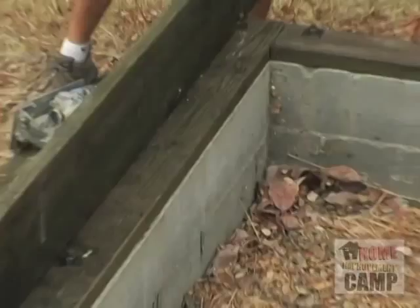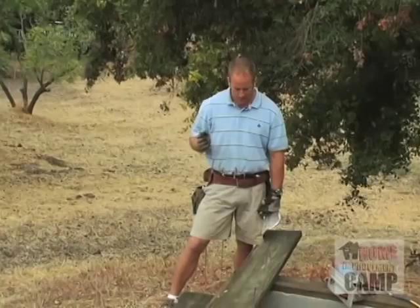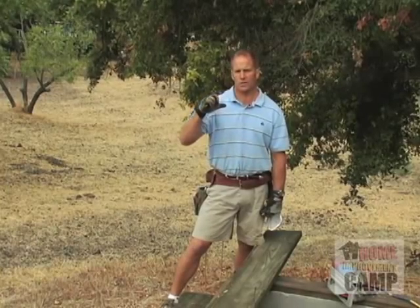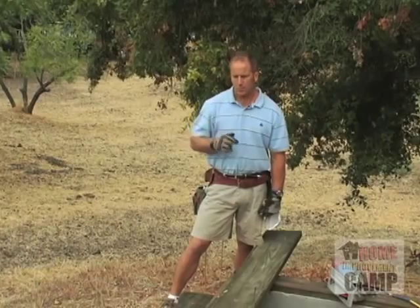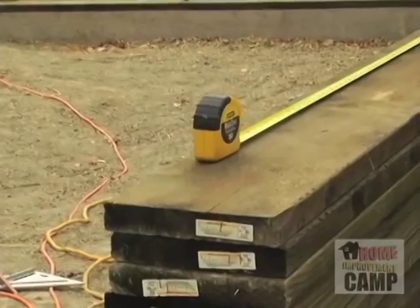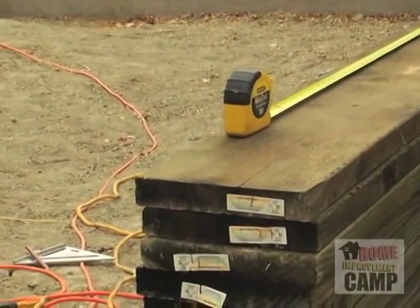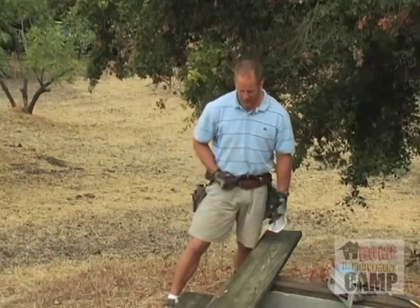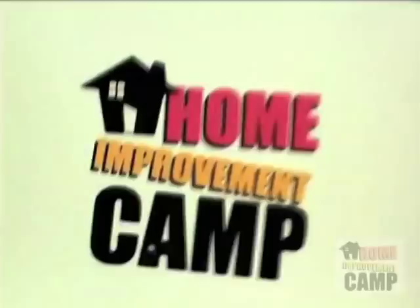This board is sitting on the foundation across here. It's as solid as it's going to get. So, if you had very small floor joists like 2x6s, you might be a little careful about how much you hog out. But here we have 2x10s, and these 2x10s aren't going to be hurt by just cutting out a portion at the bottom.